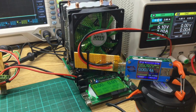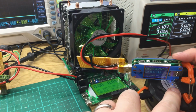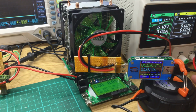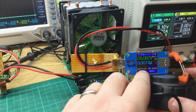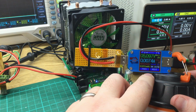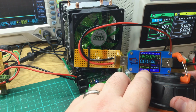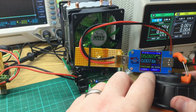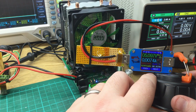Okay, this seems to have finished. The fourth light is indeed fully lit up now. It's just trickling a tiny amount of current now. It ramped down from about 1 amp to, I last saw it about 200 milliamps before it looked like it had decided that was enough. It's drawn 412 milliampere hours, but in this case I'm going to use the 2091 milliwatt hours. So it's drawn about 2 watt hours in topping this up.